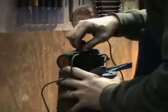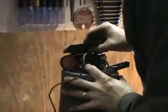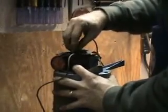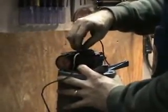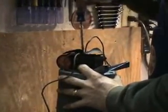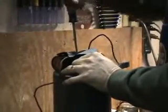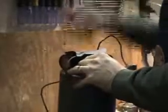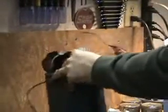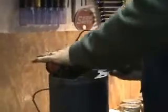So here's what you have to do: put the capacitor in its place, put the box in its place, put the bracket over those, put the paper over that, then try and get that bolt threaded down into position while balancing everything together. You might notice I already had the sheave back in place — it would have been a little easier if I had done this before putting the sheave on, because then I could balance the motor on the edge of the workbench more easily. Not sure why I put the sheave back on first.